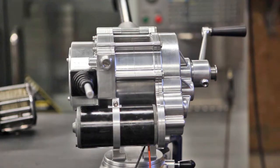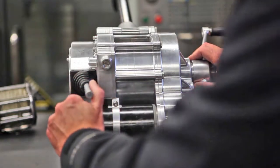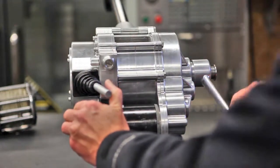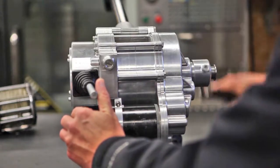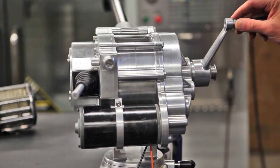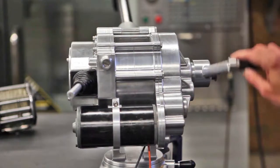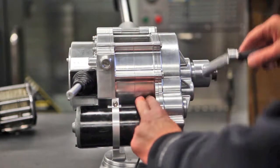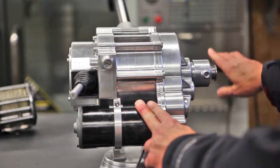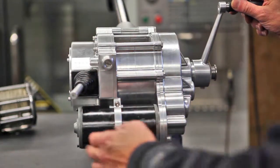And again, during power failure, the function of the electric motor is through the gear train, gear shifter. So we're in manual mode, high manual mode, and finally electric drive. In the event of failure of electric power or any other feature, you do have the ability to go into the electric mode, enjoy the 20:1 ratio in the gear train, and pull your line up quickly.